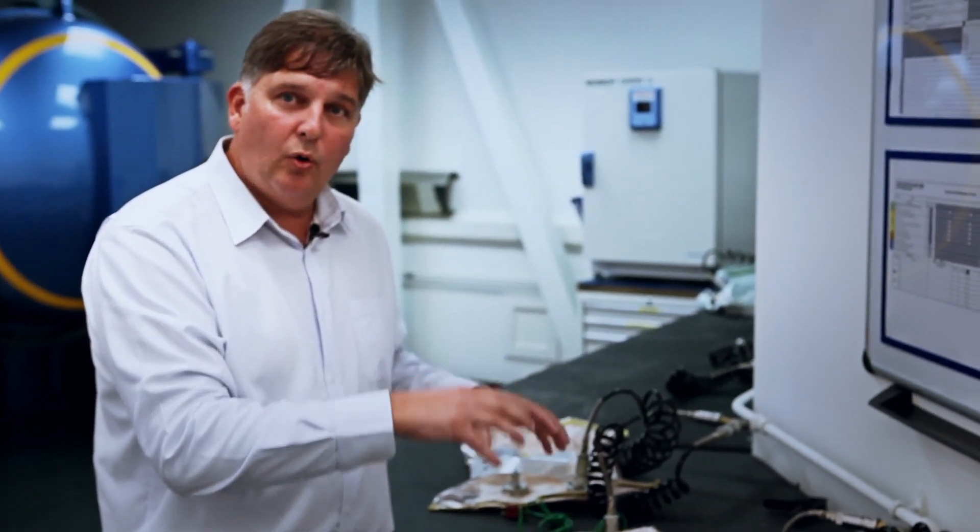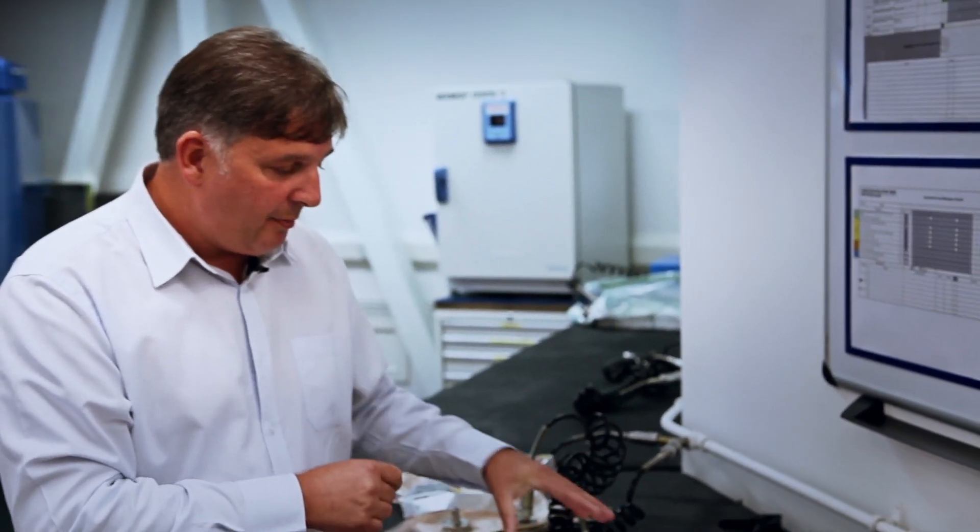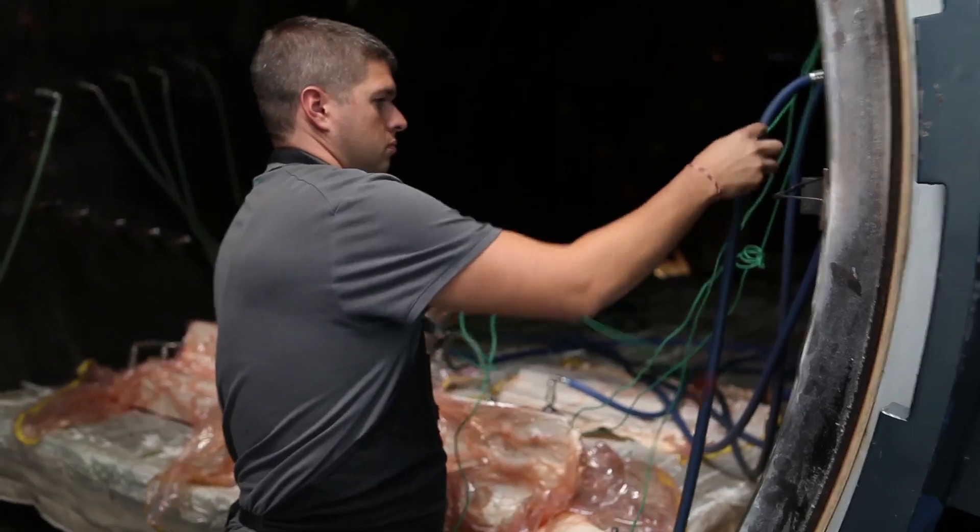What we do with this is basically we take all the air out — all the air is extracted out from the mould surface and extracted out of the bag. What that does is it consolidates all of the pre-pregs to the mould surface, taking away all of the air and giving us the perfect surface that we've got from the mould, and then from here these are loaded into the autoclave and cured.